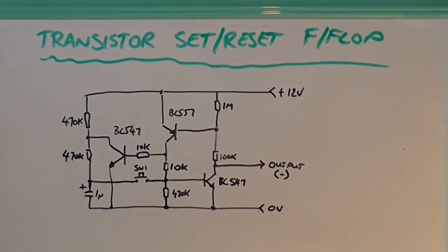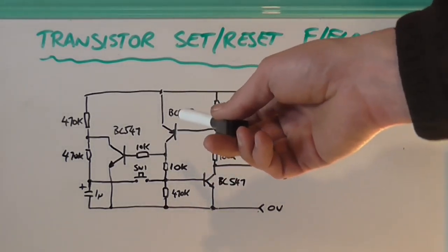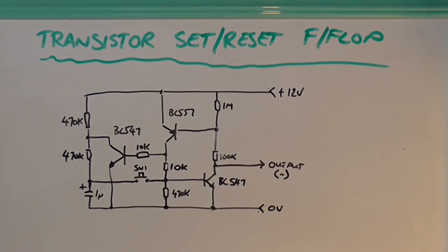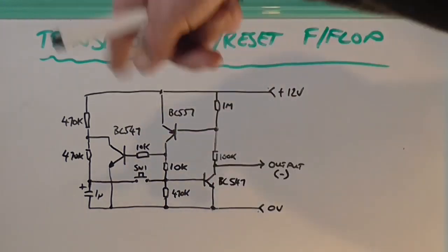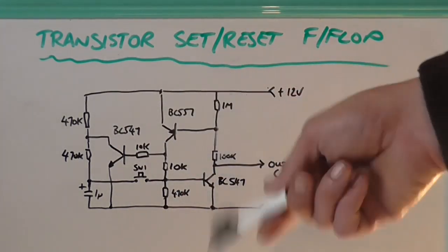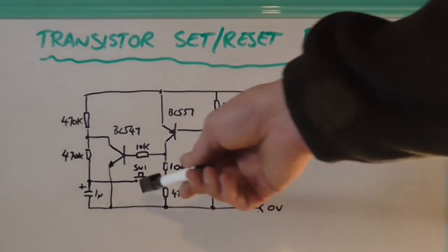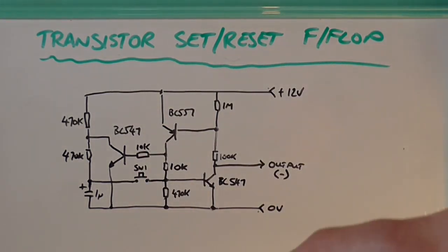So first off, what would you use this circuit for? Well, you could use it as basically a momentary switch — a power button for something. A lot of amplifiers did actually have little tactile switches as their power button. If you push it in, you could hear a relay inside the unit click, which would turn the main AC power to the transformer on. You'd need a permanently connected power supply transformer to the mains all the time for that to work. And of course, you could add infrared remote switching across the switch as well, so you could do it from a remote control.